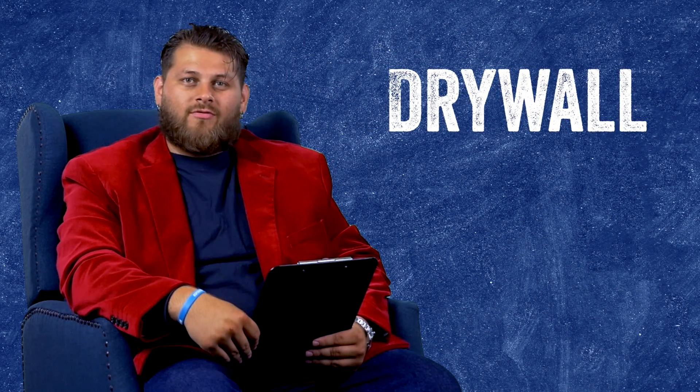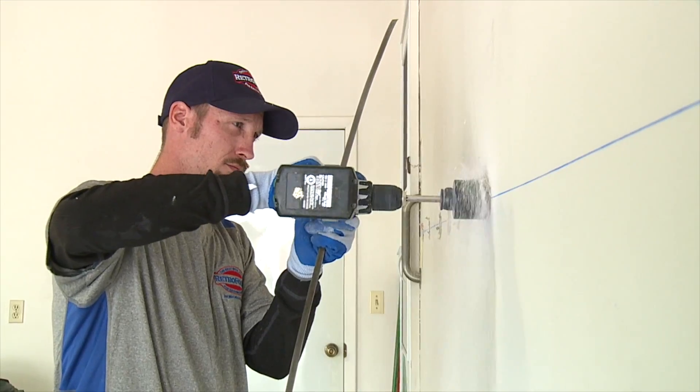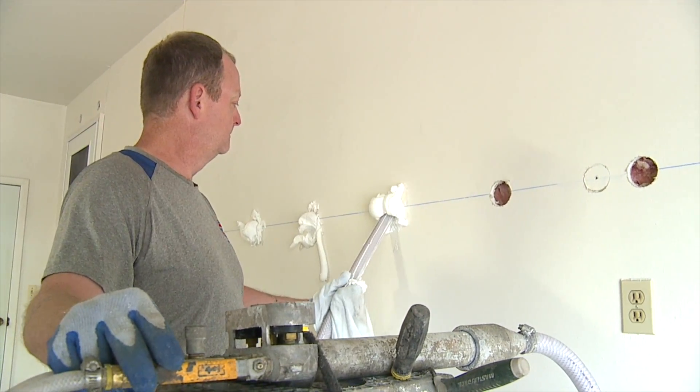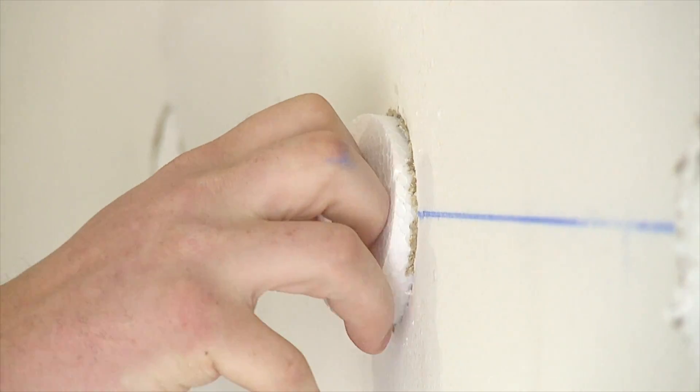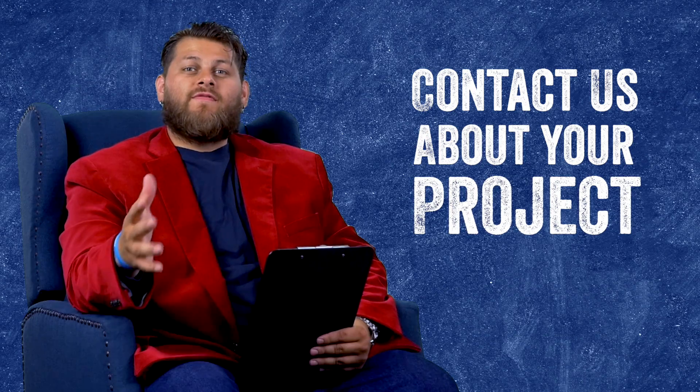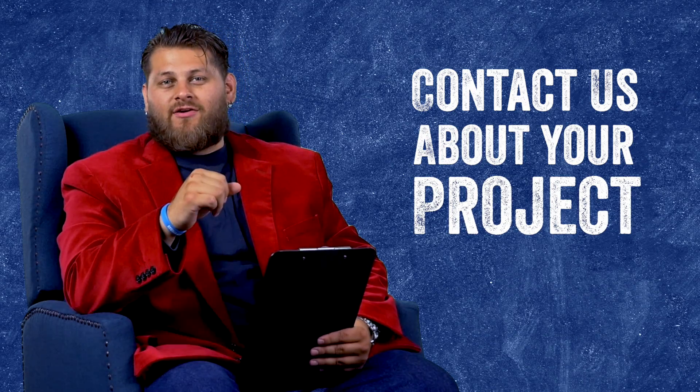If we're doing an install through drywall, we drill our standard two-and-a-half inch hole, fill every stud cavity up with foam, and once we're done, the crew puts a plug in and the first coat of mud on for you.